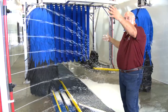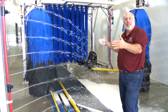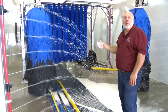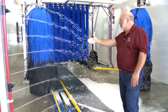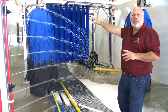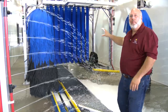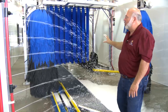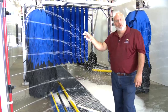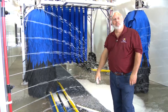This is aimed always down towards the tunnel because we want to leave that alkaline on the car as long as we can. This has two sets of alkaline arches, so on a high-speed conveyor they can actually run two, or they can run a double clean on vehicles that want extra cleaning. Each wraparound will have its own foamer. This is a reverse wraparound, so we have it mounted on the back side of the applicator arch because we want to get the soap on the car before the wrap touches it. On the other end of the wraparound, you'll mount your foamer on the exit leg of the emitter, again spraying the car before the wrap. It's always important to do that. More air creates dry foam; less air with more chemical creates a wet foam, and here we're looking for a wet foam with a lot of lubricity and good content that makes it safe to use and operate.